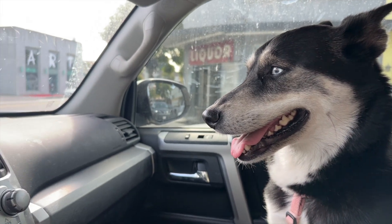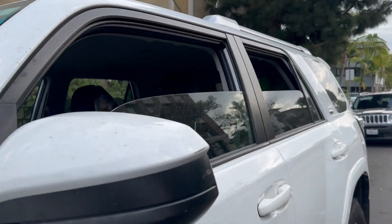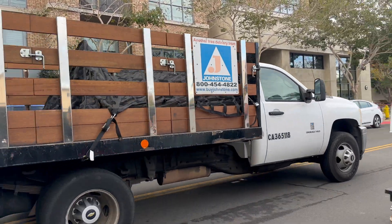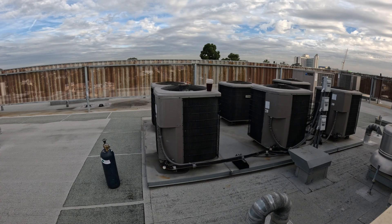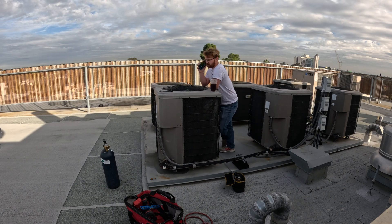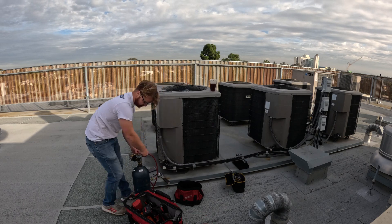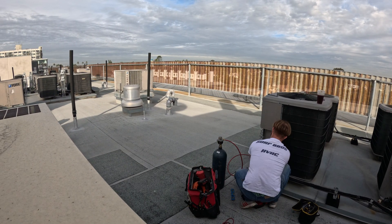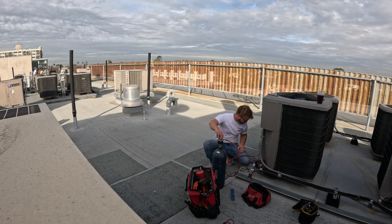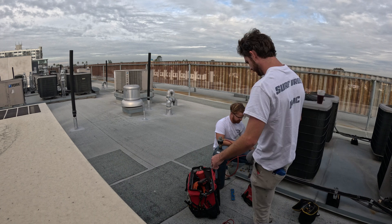Here's me and Reyna pulling up to today's install — it's a Bosch heat pump on a rooftop here in sunny San Diego. It was a little bit of a weird one. We replaced the outdoor unit and the indoor TXV. The reason we did this is because the indoor equipment is no longer manufactured in the tonnage that this customer has in their home. We checked with several alternative manufacturers and several suppliers and couldn't find anything available in this tonnage of this system type anymore. The customer was without heat, so we did what we could and made do with what we had.